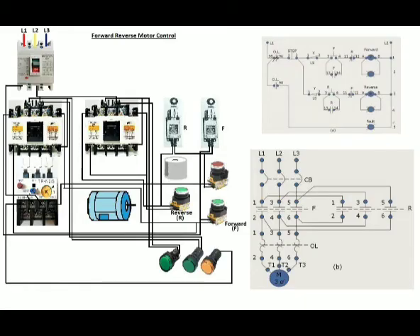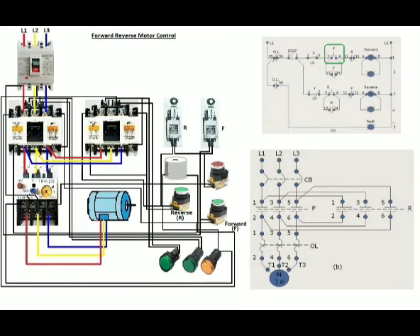The load side of the circuit breaker will be connected to the upper terminal of the forward magnetic contactor, then the lower terminal of the forward magnetic contactor will be connected to the upper terminal of the overload relay. The lower terminal of the overload relay will then be connected to the electric motor. Line 1 color will be used as red, line 2 color will be yellow, while blue for line 3. The lower main terminal of the forward magnetic contactor will be connected to the lower main contact of the reverse magnetic contactor, wherein the yellow wire will remain connected to line 2 while line 1 and line 3 will be interchanged in the connections. The fault lamp will be connected in series with the buzzer and will then be connected to line 2 of the circuit breaker load side. The upper terminals of the main contacts of both the forward and reverse magnetic contactors will be connected to each other, common to the load side of the circuit breaker.